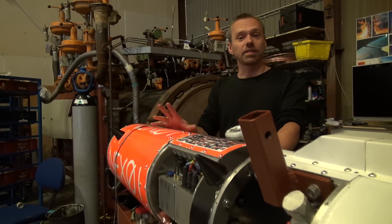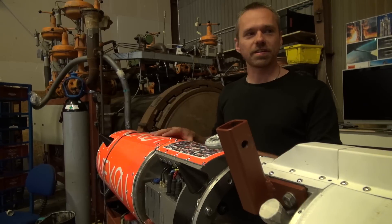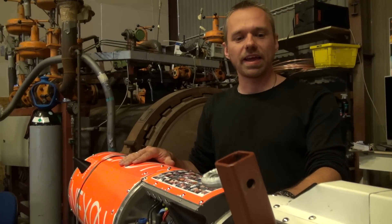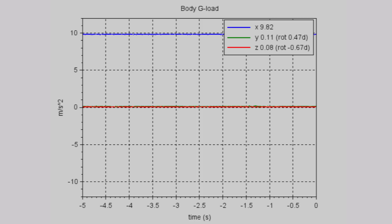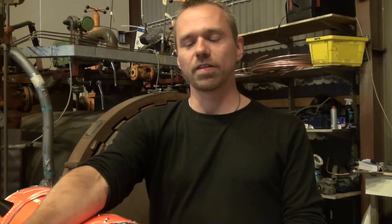We do this using gravity, because the unit has accelerometers that can sense the gravity lift on the rocket that prevents it from falling to the floor right now. We can lay the rocket down, align it so it is perfectly horizontal, and then we know that only one of the accelerometer axes inside the IMU should be detecting the gravity lift. If we see it on the other two axes, this is an error that we can correct — electronically, by creating what is known as a rotation matrix, which is the mathematical way of transforming the measurement from the component into the actual orientation of the rocket.